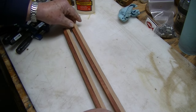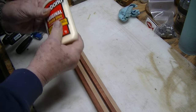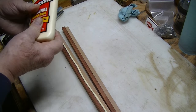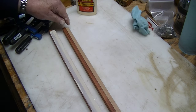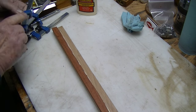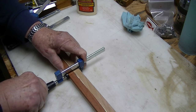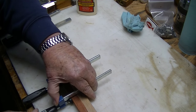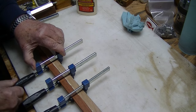Here are my two pieces. I'm laying them out so there's the square I want — there are the two faces that have to be glued. So we'll do the same process all over again. I'll add glue, spread it out, and then clamp these two pieces back together again. It's still not quite to three-quarters square, but I am spending a lot of time on sample preparation here. I'll also cover finishing to the same amount of detail. So I'm clamping them back again, allowing the glue to set, and then we'll bring this piece back into square.